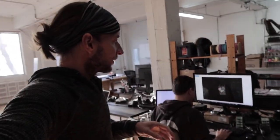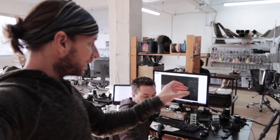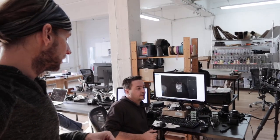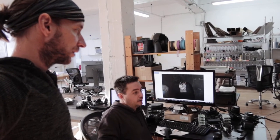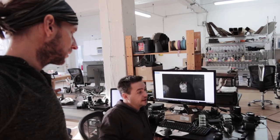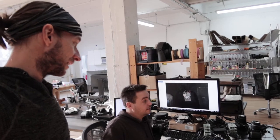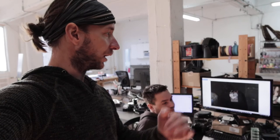Okay, so globally, each camera model is tight with each other, but between the three models, there's huge difference. Yeah. The shutter delay varies a lot, and when the mirror lockup is enabled, the SL3 are slower, but they give a better synchronization. Yeah, 1/10 of a second slower. Yes. So that might be an issue if you want to get your subject while jumping, but maybe not.